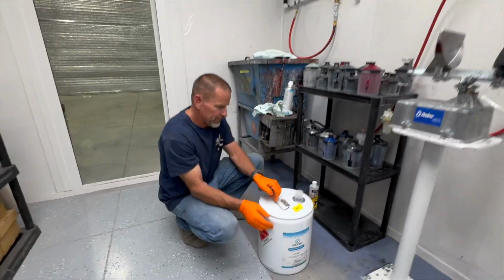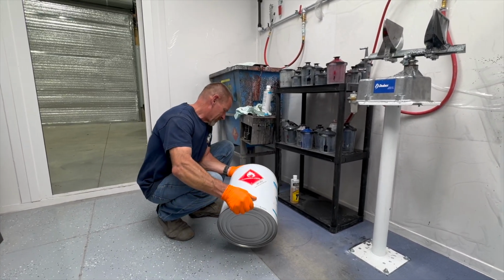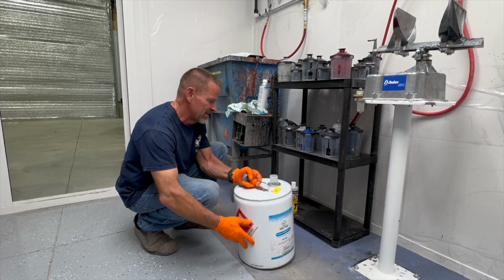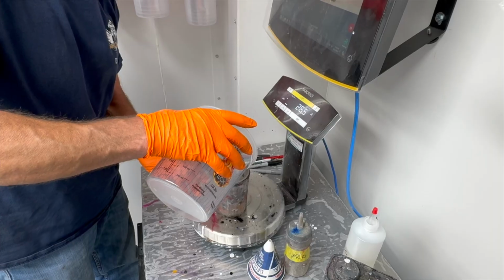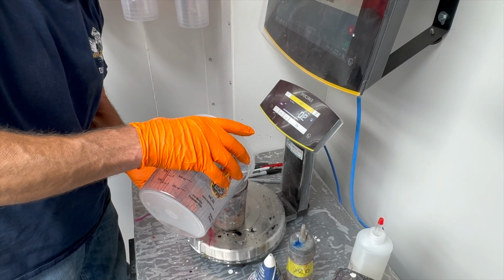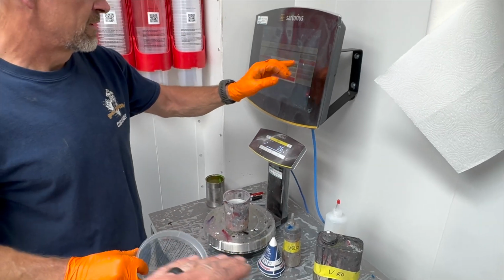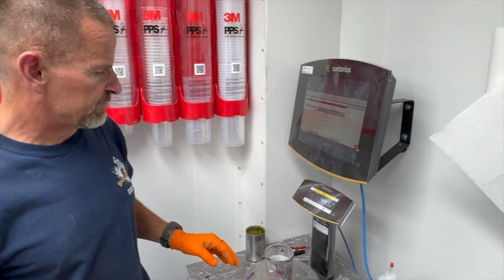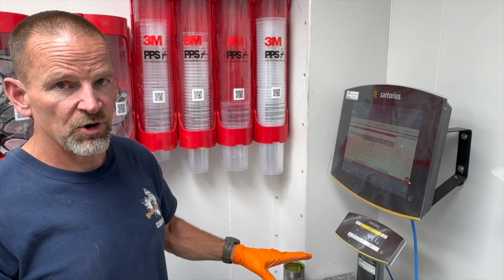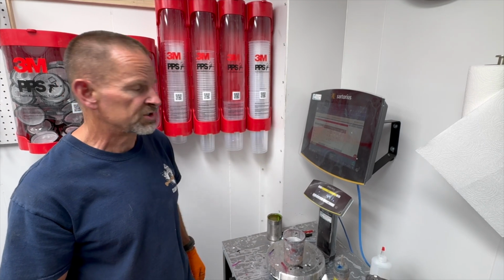So like I said, I'm not a paint guy. This is the paint master right here. I'm just the film guy at this stage. I'm gonna be spraying it, but he's really showing me what to do. This is just lacquer thinner, but at the edge it works as a reducer. So reducer just means that it thins it out. Thins it out, makes it a little smoother. If you were using it more like a layer on your primer, you would do the reducer, it'd give you a little thicker build, but it'd be a little rougher texture.